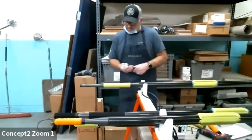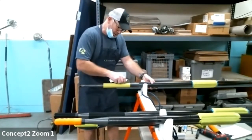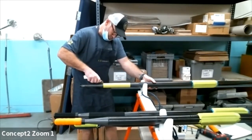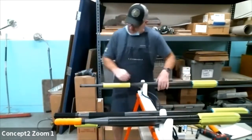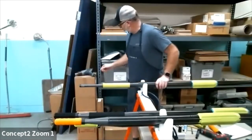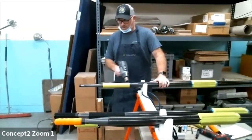Then I take a knife — you have to be really careful. I go down through; each handle has two seams, a seam on either side, and I try to follow the blade right down through the seam. That way you're not scratching a new part. So you just slice through the green and try not to slice any of the handle. Then often times you can actually peel it off. But sometimes it's stubborn and it really sticks, so I like to heat it up a little bit. I take the heat gun and heat it up for a couple of minutes, and it comes off a lot easier.